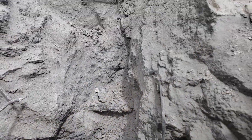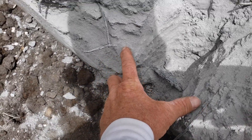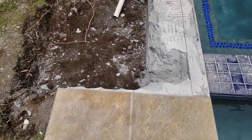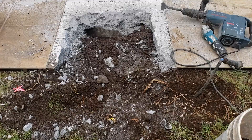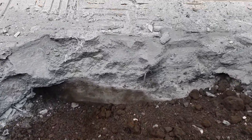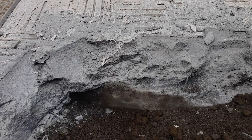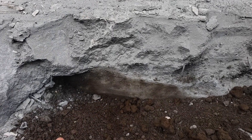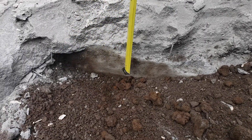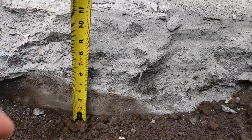Don't forget that you need to expose a considerable amount of rebar. We're going to open this hole up a little bit farther so that we can bond the chair — the shell of the swimming pool. Once you've hammered back and found the actual pour for the pool, you can measure again. You're going to need to drill this way and put some rebar in there for strength. And there's our ten inches right there.